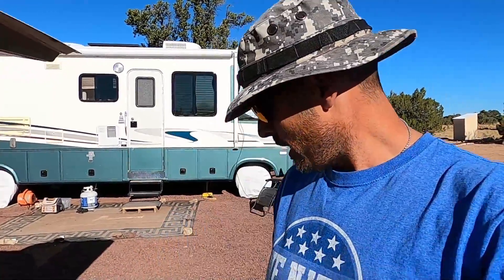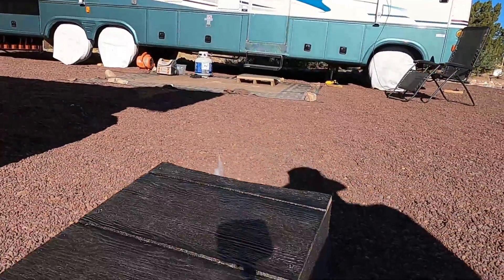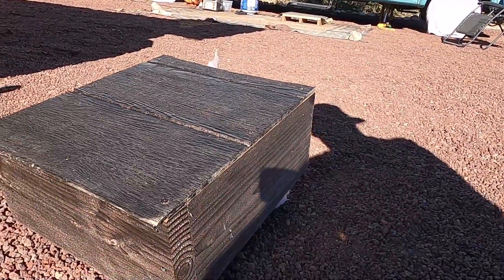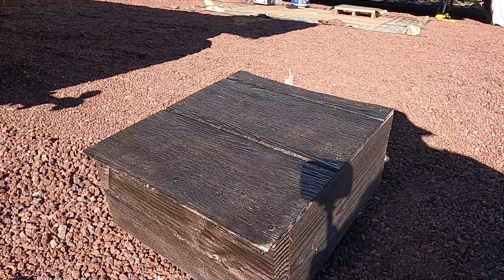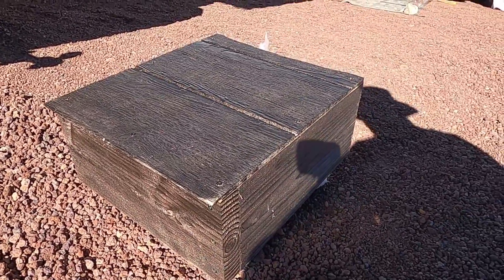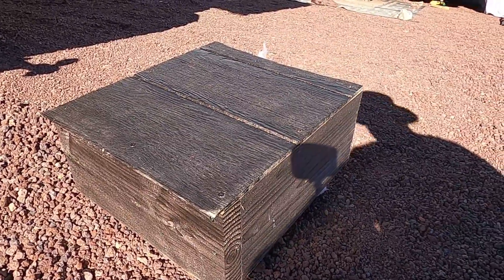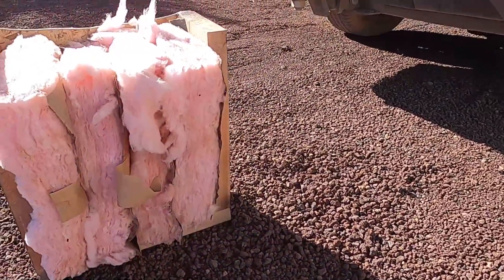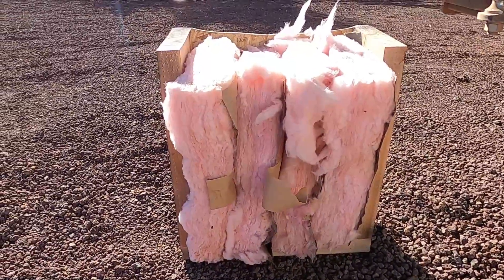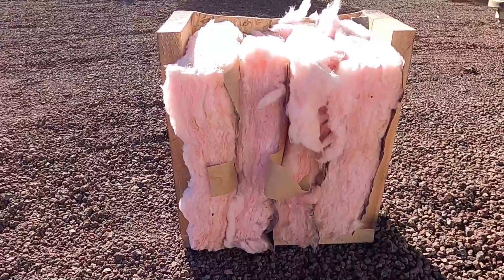I finished making the box covers for our water tank valves — one for Bruce, one for Aja, and one for us. I took Bruce his yesterday and visited with him for a little while. This is basically the finished product — just the 2x8s screwed together with some leftover T111 siding. I used up the scraps and it's painted black, close enough. I cut some pieces of fiberglass insulation to put inside around the valves, and that's what's going to keep them from freezing this winter.